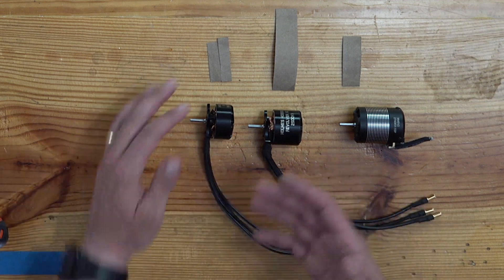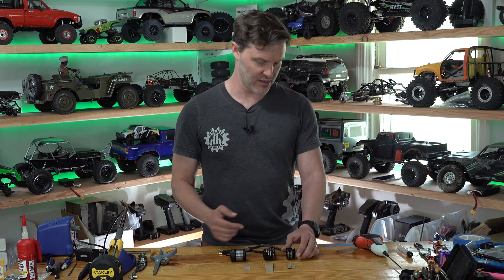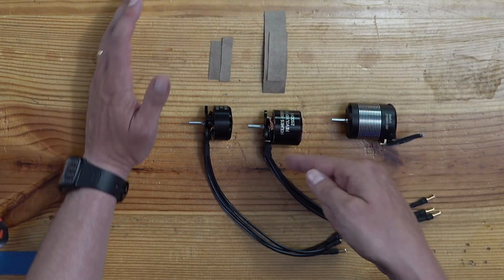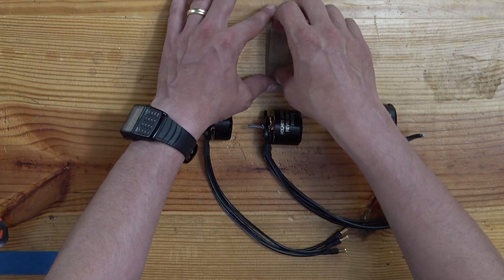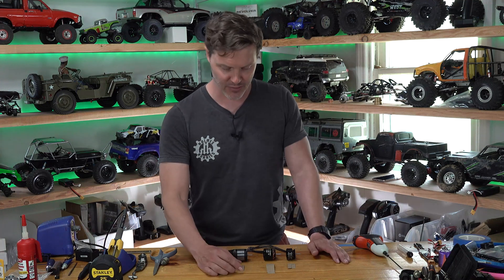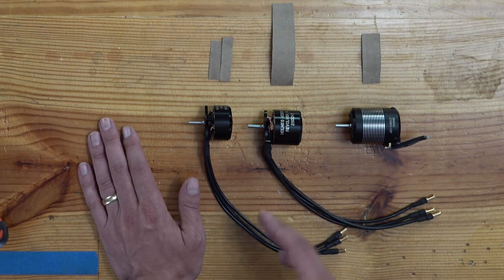Because of the smaller housing, the temperature of the motor will run hotter — it just has less place to shed heat off of. That's the one downside of the outrunner: you have all of this flux gap area, but a lot less space to get your heat out. That's why they run hotter; in a crawler, they're typically going to be the hotter choice, whereas inrunners are going to be the cooler but heavier choice. The outrunner is probably going to run a little bit hotter with a little bit less efficiency because it doesn't heat-shed quite as well. To get into the better power density, we would almost have to do some heavy equations to show you why inrunners can typically have better power density. But if they're all the same KV and all being run at the same RPM with the same voltage, your outrunner is going to have better torque density and also better power density — because you're not pushing the inrunner hard enough to get it into that zone where it really starts to shine at high RPMs.